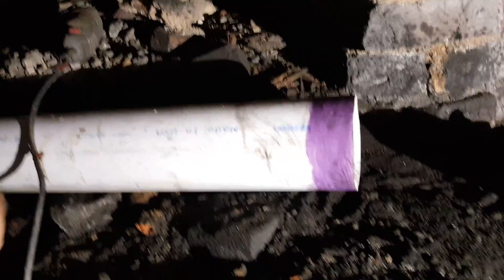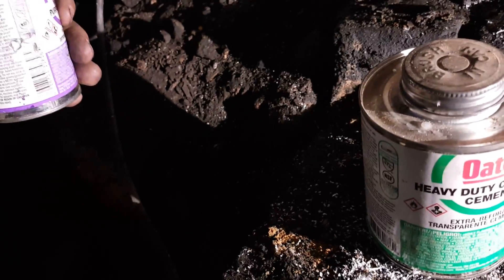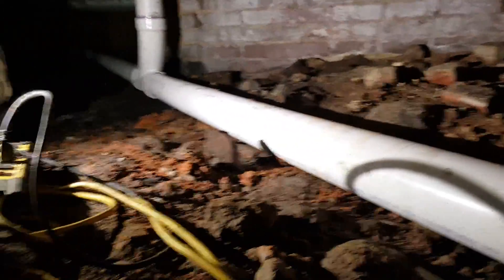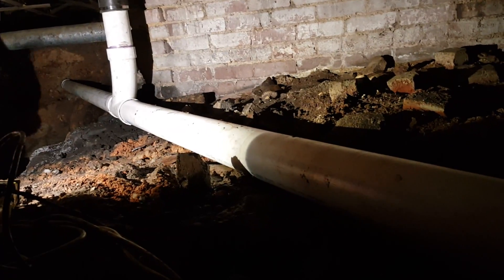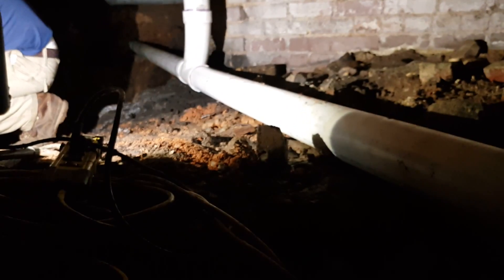As you work with your new transition to PVC, make sure you clean your pipes and every joint properly. After that, we're going to use this heavy-duty PVC cement — you can use regular standard PVC cement; this is not for pressure. You can see the new line all the way toward the front of the house. Everything is well installed, properly supported, and has enough inclination so you don't have any more rotted pipes leaking sewer line into your house.